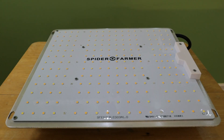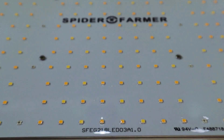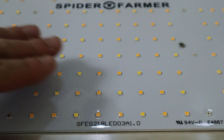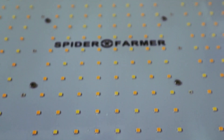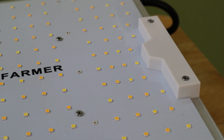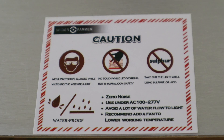Here's the business end of the lamp — the part that generates all the light. It's got a glossy silicone coating over all of the LED chips so the circuitry isn't exposed directly to moisture. They've also covered the plastic block over the wiring that comes around from the driver on the backside of the aluminum plate. From the core connections and the way they've covered the LEDs and wiring, they've taken reasonable care to make this waterproof, and the label says so. It does say to avoid splashing a lot of water on it, which is a no-brainer.